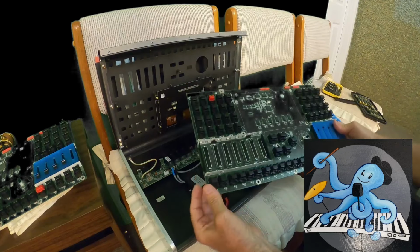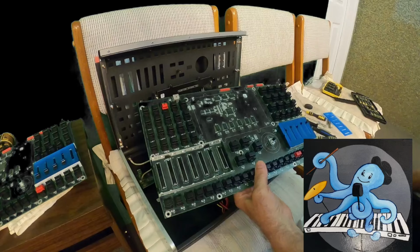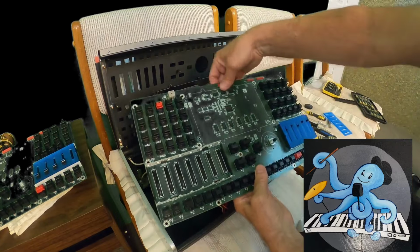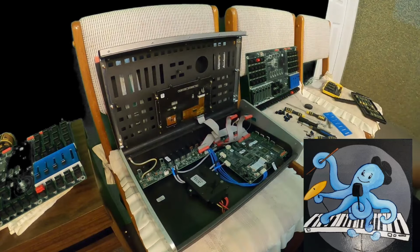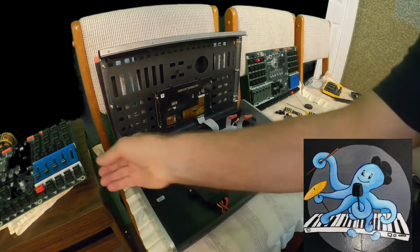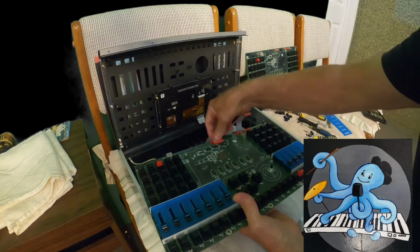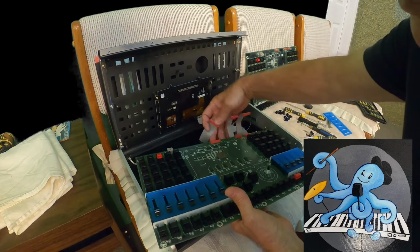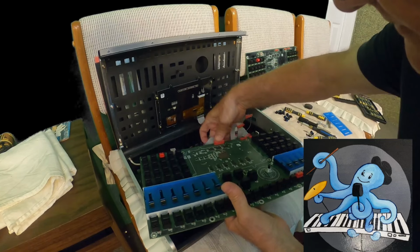In the first series of those keyboards, some keyboards had a problem with those lights. In the beginning, they just change color without any reason, and then after a certain period of time, they stop responding. Now, that part, as I assumed, is nothing but those three connections. I am going to put the brand new part that I bought from the company, from Ketron. Again, everything gently and very carefully. I want to make sure when I turn it on that everything is working properly.